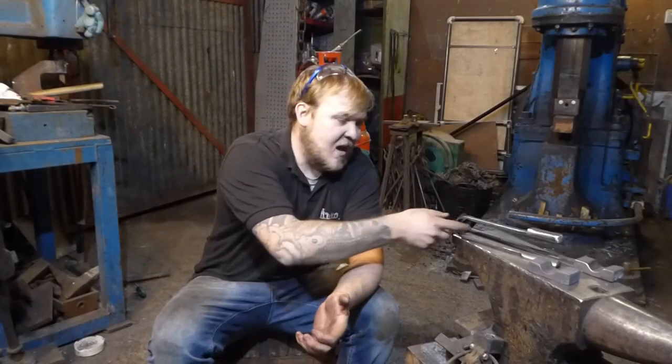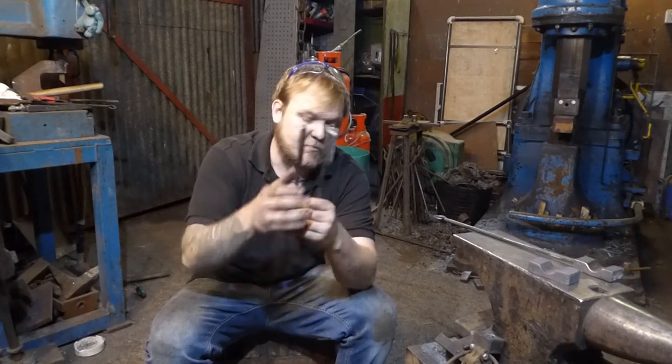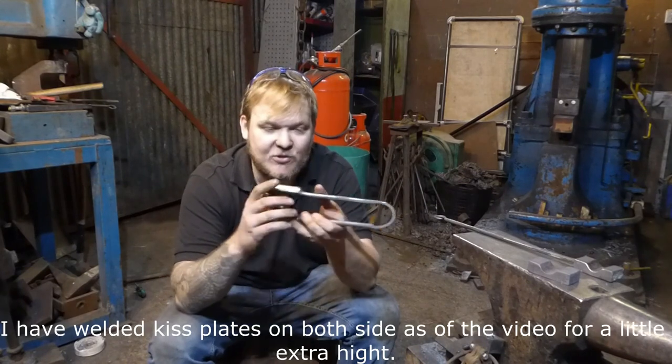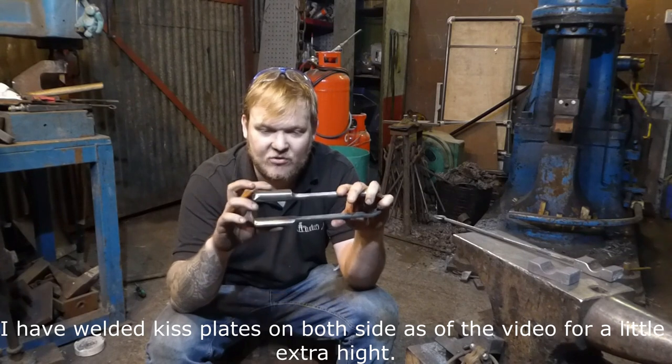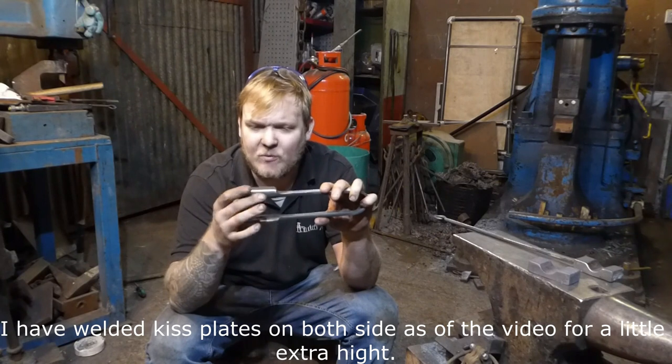Hopefully you enjoyed this video. A few things I didn't show in the video was I just heat treated this piece back here just to give it a bit more springiness. And then I've also welded this little kiss plate on just to give me a bit of extra height, and also to stop this backside of the tooling mushrooming up too much.